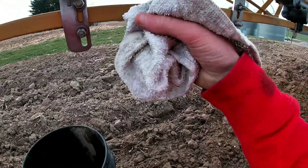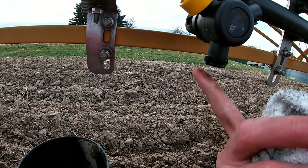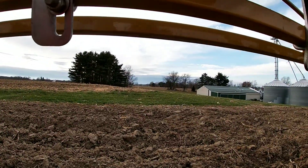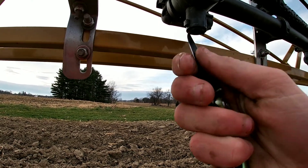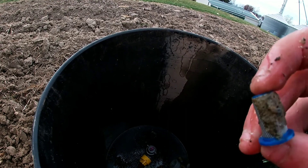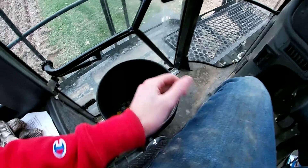What I'm doing right now is taking all the nozzles off. We've got two on each three-nozzle body — we could put three, but these put down a different rate per acre. I think one of them is like 12 and this one's like 20, or vice versa. Sometimes you need a knife because the strainer gets stuck. This is what a strainer looks like — they're a little dirty but they keep stuff from going out the boom. Whatever we sprayed last really got them dirty.